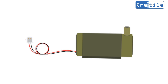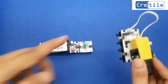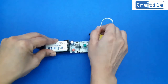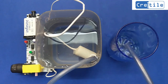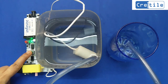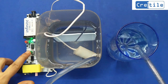Let us test and understand the working of the submersible pump motor. The submersible mini water pump can be used for pumping water. Connect battery, switch, and motor module in sequence. Connect the motor module speed pin to the output of the switch, and mount the submersible motor to the motor driver. Now immerse the pump completely inside the water and power ON the assembly. As we switch ON the switch, water will pump out. This is how we can use different motors based on their usage in the project. Thank you.